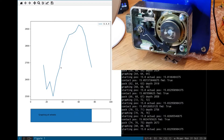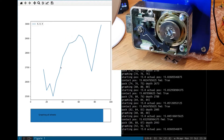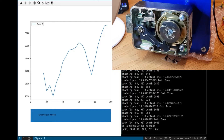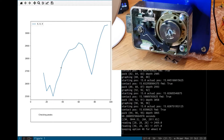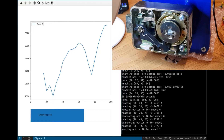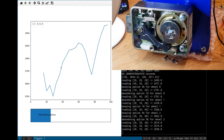With the 1548 there's a lot of wheel shadowing, because there are high spots on all the wheels since the holes in the middle aren't centred. Conveniently though, that means the low spot on each wheel is easy to find because it's opposite the peak. So after I get this graph, the algorithm goes and starts looking at which peak is coming from which wheel or wheels, then works out which combination of wheels to set opposite to which peaks to get the fence as low as possible — the best possible starting point for graphing. It's just sorting that out now and then it'll choose a wheel to start graphing.